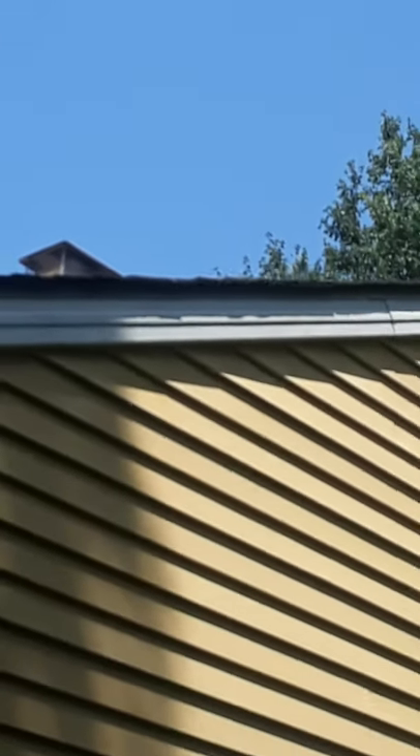If you can't put a lip on top — in this case I slid underneath a piece of roof edging, and I was glad to do it. But in order to eliminate the oil canning, I put that Brake Buddy rib in there. I've been using it on every job I do as far as aluminum trim work.